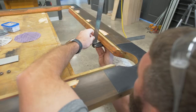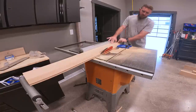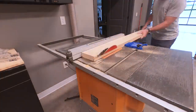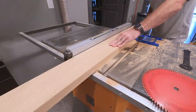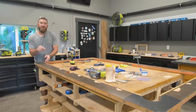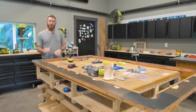I've got my angles for the top and the bottom of the inside of the rails, and I'm going to start by ripping all of those two-by-six-by-eight-foot-long red oak boards down to those angles on the table saw. After that, I'm going to move on to cutting these dados — the dados are what holds the felt in place. You place the felt, smash in a feather board which cinches down that felt, and then roll it back over top of the bumper.